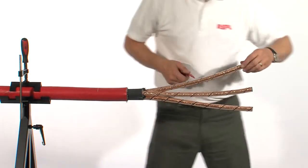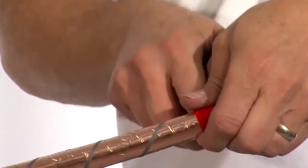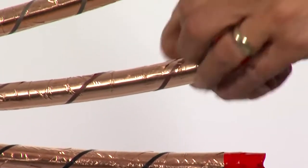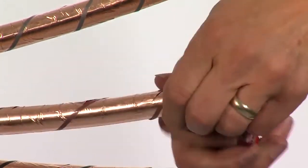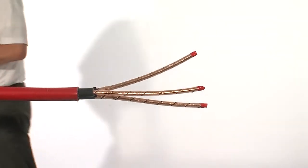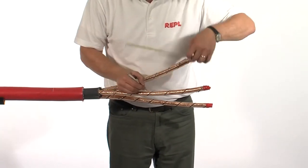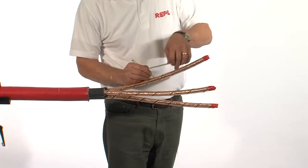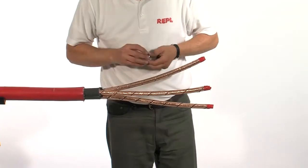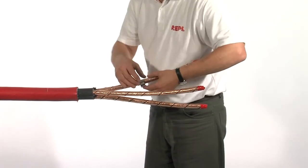It may be advisable to use a band of PVC tape or something similar at the end of the cores to prevent the tape screens from unwrapping. Mark the screens where they need to be removed. Use a constant force spring or something similar over the mark previously made.